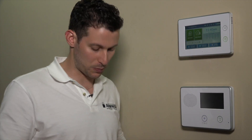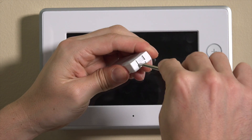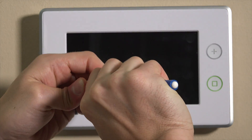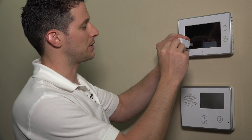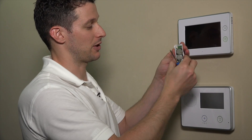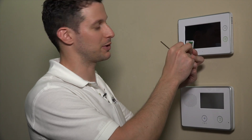So first what we'll do is we'll open up the box. Inside, we'll see two parts — we have our sensor here. There's a tab on the bottom where we can pop this open and release the tamper cover from the back plate. We use a flathead screwdriver to depress this tab and open up the sensor. I will admit this is one of the harder sensors to open, so just keep that in mind and be a little bit patient with it. That's another reason why we generally prefer the Honeywell contacts, but these do come with the kit and they're great sensors as well. Just don't get frustrated — take your time with it.